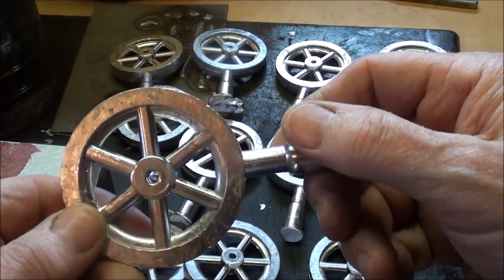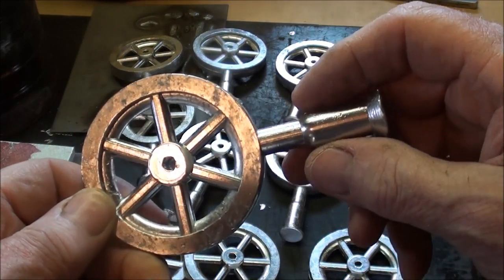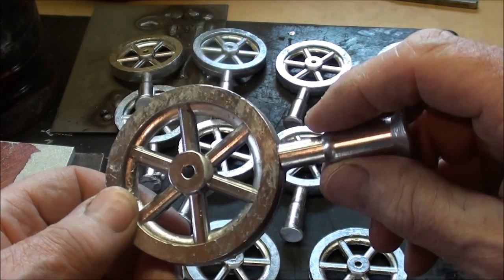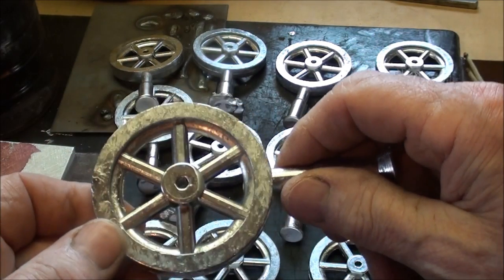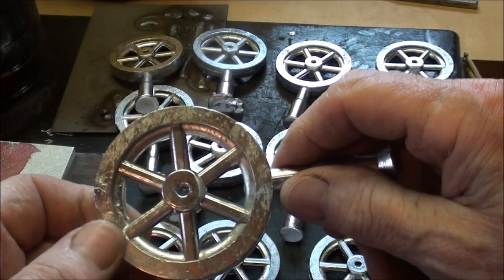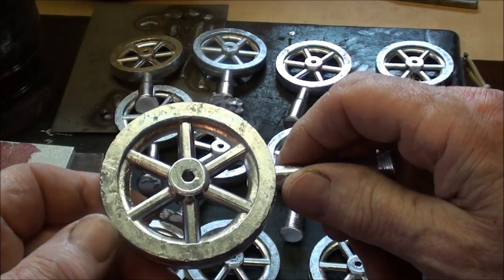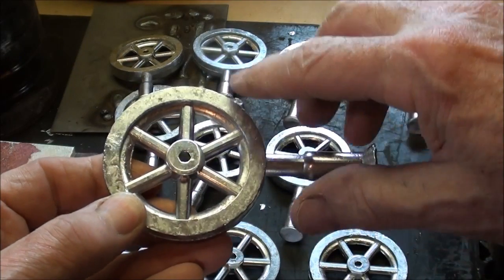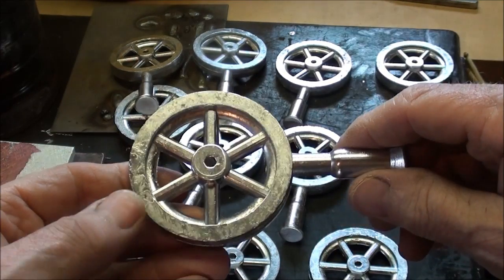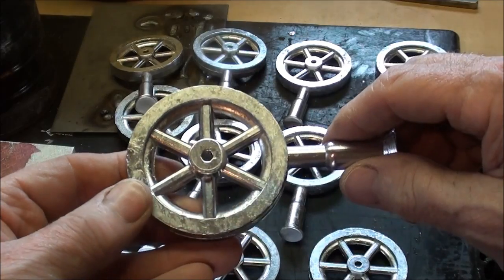Ream the hole. I think I'm going to go through and show all the finishing operations on this also, so this will be one heck of a long video. Now, why do I make these out of lead instead of aluminum? Because I want the weight, the inertia. And remember, when we've got spoked wheels, most of the weight is out on the rim, which is where it needs to be, not necessarily near the middle.